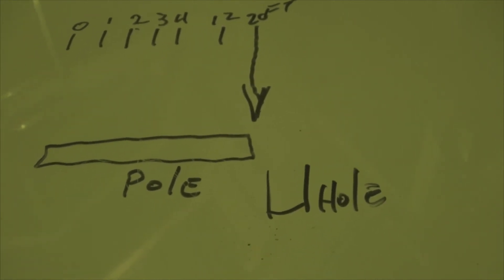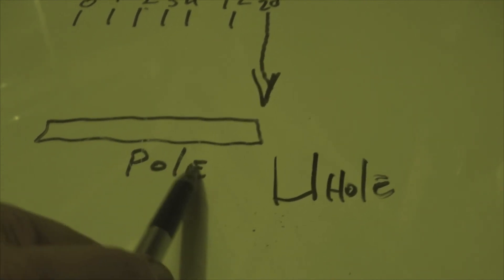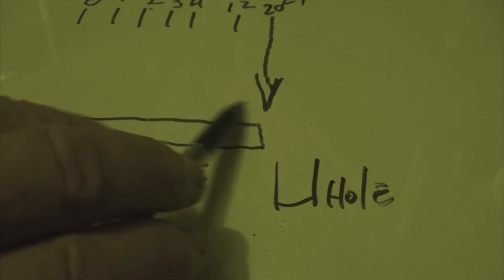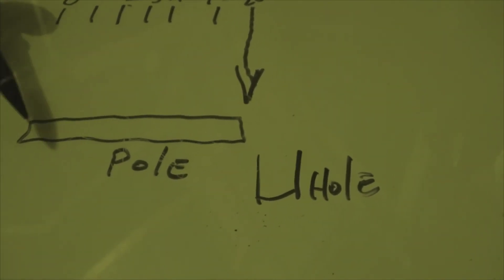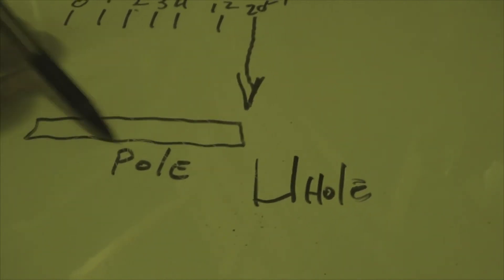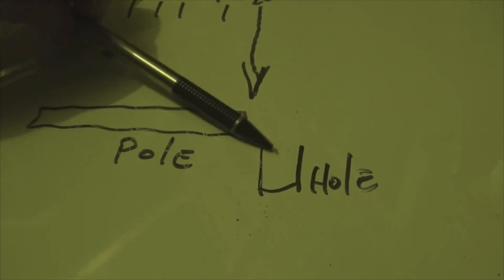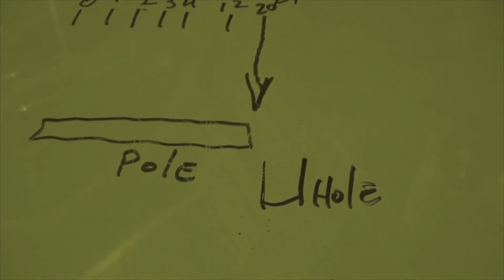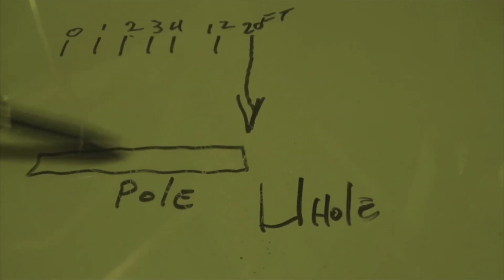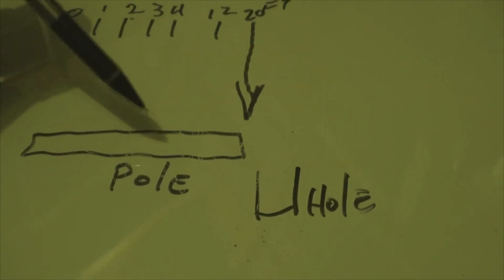You can get hurt. What they generally do to be successful is they dig down whatever depth — five feet or whatever it is — and then they cut a path down in here, five feet, and then they start lifting up, and then it works better. We could get into the obelisks in ancient Egypt and how they lifted them — they did the same thing. They built ramps, then had these down angles, they dragged the thing out, then they'd start standing it up and use ropes to pull it up. That's how they built those ancient obelisks. However, when you're doing this stuff, you need to really understand what you're doing. There are a lot of videos on the physics of lifting poles into place by hand. People get hurt doing this.